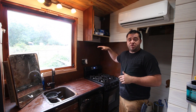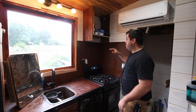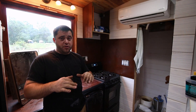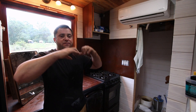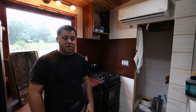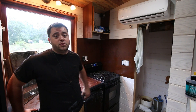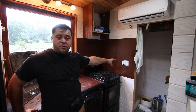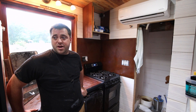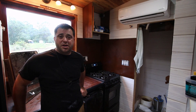So after I did this whole project, I went online and looked at pictures of rusted backsplashes and found that under-cabinet lighting really made these things stand out and look so much nicer. My range vent does have a light in it, so hopefully it'll make this look a lot better. I know on camera it doesn't look great. Just a disclaimer — if you're going to be using that muriatic acid, use it outside. Don't have it near any other types of unprotected metal. Muriatic acid vapors alone will flash rust any raw metal that doesn't have a protective coating. A lot of my tools ended up getting rust all over them. Set it up outside and do it away from anything you could possibly care about. I was probably going to replace all the light switches to brown with an aged bronze cover plate, so it'll fit. I think the whole house I'm going to do that, or at least a dark color.